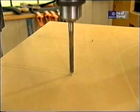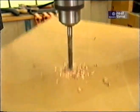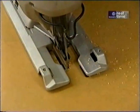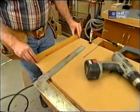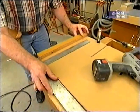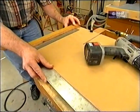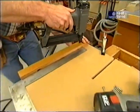These holes are needed for the bar clamp slot. I'm starting to cut the slots with a table saw and will finish them with my handheld jigsaw. Now I can install the stop — a piece of inch-and-a-half wide, three-quarter-inch plywood. Even though I know my panel is square, I'm still going to use my framing square to confirm it. Set that in place, tack it with some brads, and permanently attach it with some screws.